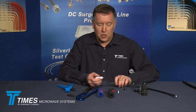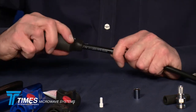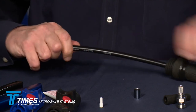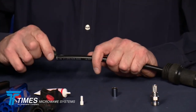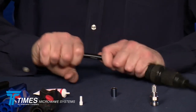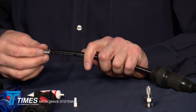We'll take our silicone lubricant and place just one drop onto the cable. We'll take our molded silicone boot — our overmold IPB boot — and place this over the cable, like so. Slide that back on the cable. Since this lubricant dries so fast with no residue and it's environmentally friendly, we'll put one more little drop on there, then take our WSB-400 boot and place that also over the cable and slide it back a little bit. Now we'll take our crimp ferrule and place it over the cable.